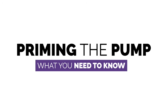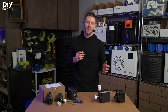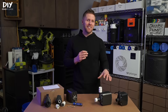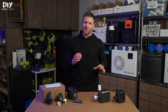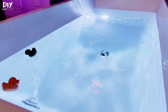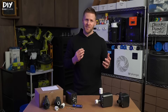If you subscribe to the channel you'll hear me talk about priming your pump. All that means is that you have water flowing freely from your tank into your pump without any air or other blockages obstructing the flow. These pumps are excellent at pushing water but they can't pull water, and it is absolutely critical that you don't run these pumps when they're dry or not properly primed. Remember, if the pump is plugged in it's on, so just leave your pump unplugged until you're sure you're ready to turn your system on.